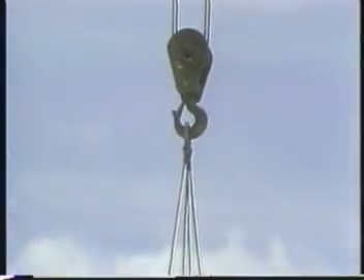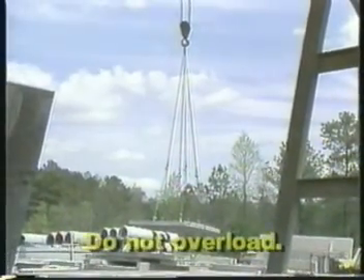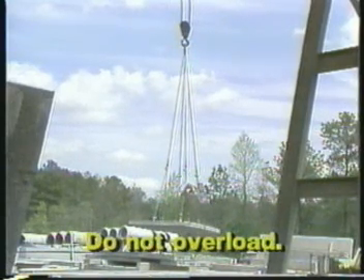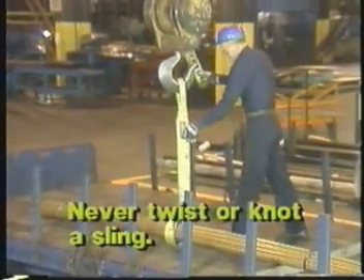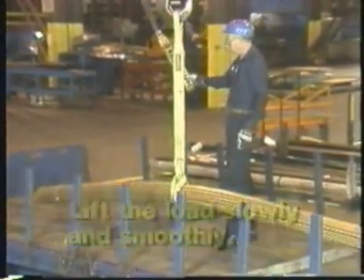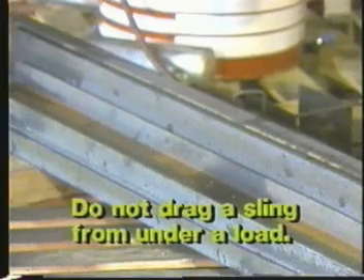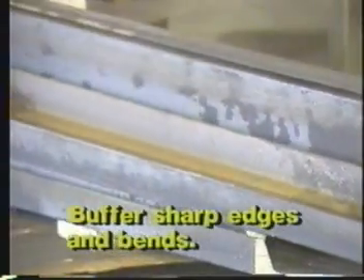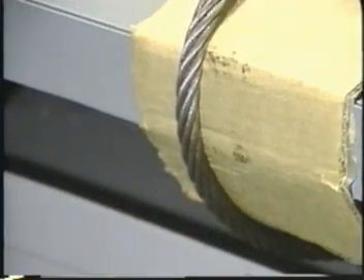Whatever kinds of hardware or slings you are using, there are some rules that must always be followed. First, be sure that whatever you are using has a rated capacity greater than the weight of the load it will carry. Never twist a sling and never tie a knot in it. Lift the load slowly and smoothly to prevent jerking. Do not try to drag a sling from under a load that is resting on it. If the load has sharp edges, use some kind of padding or buffer to round them off. This will protect the sling from being cut or gouged, and in the case of wire rope, it will soften the bend and keep the rope from being kinked.